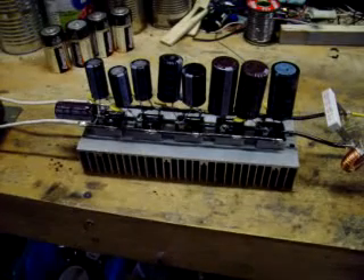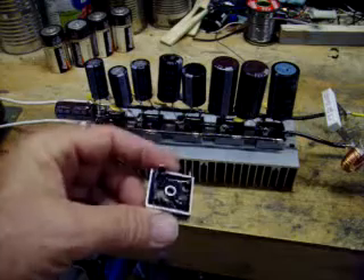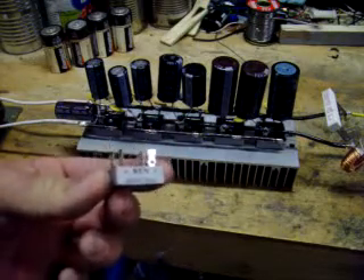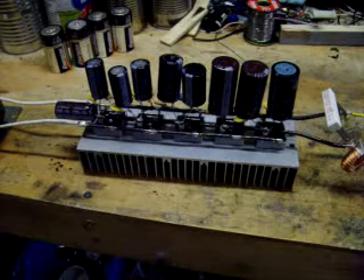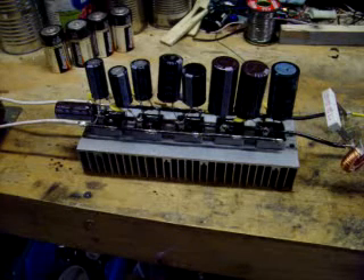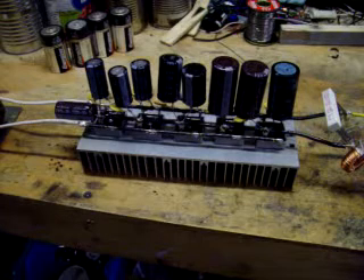This is the power supply I built. I started out with one bridge rectifier. If you found some of these bridge rectifiers on eBay, they come from China — rated 1,000 volts, 50 amps, but they really only take 15 amps, and then they blow up. I blew up several of them. Once I started pulling more amps, I had to change to two rectifiers, and I blew both of those up. Now I have five rectifiers in parallel.